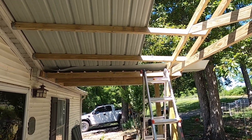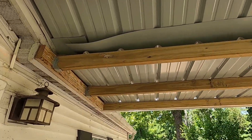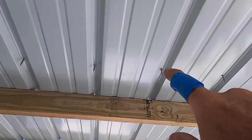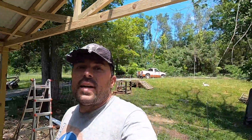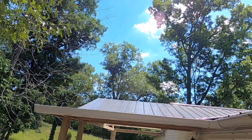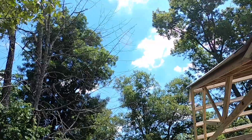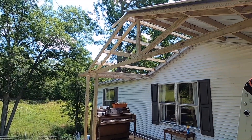Got the valley flash in, got two sheets on the long portion of the gable. I'm going to put a little screw in here to hold that into place, and you can see where the screws are through from that flash — I've cut one off with the angle grinder and I'll cut the rest off as well. Now I've got half of the roof done, all the metals up. Gutter's good, I've done a leak test, everything is looking good. Got it marked for my downspout cutout, drip edge all down that side, and I'm ready to start the other side — but first it's lunch time.